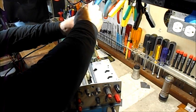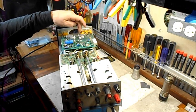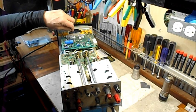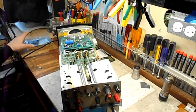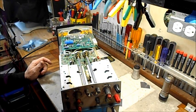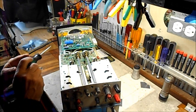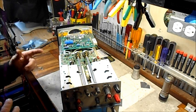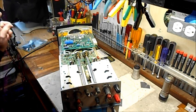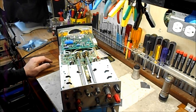What I did was get in with my desoldering tool and vacuumed the outsides of these two 2200 microfarad caps, then stood them up, put the soldering iron right on there and pulled them out as it heated up. Here are all the old caps from the board. I fired it back up again afterward and I think something cleared up — I wasn't having any sweep. I checked the 3.3 microfarad 160-volt cap and it had a really high ESR on the meter.